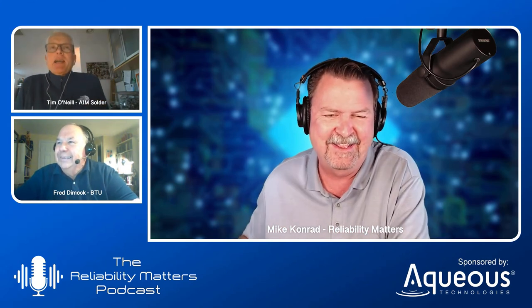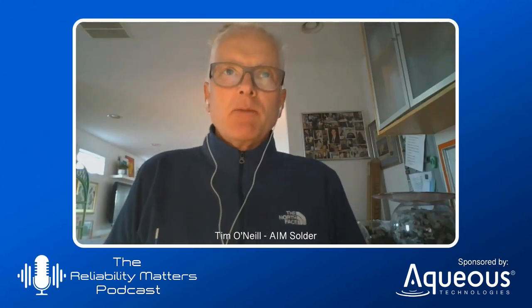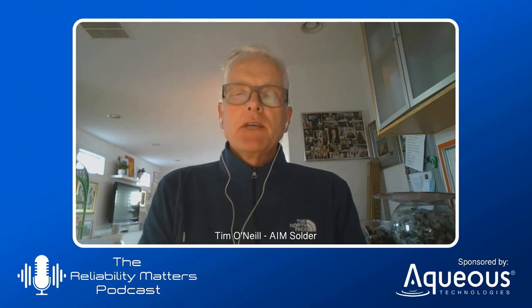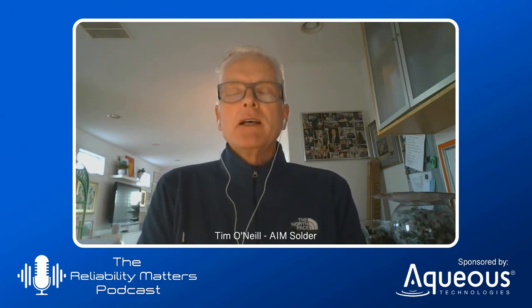Well, define perfect, right? So "I'm following your recommendation" is often what we'll hear. What they mean by that is they've tried to match up our online or published recommendations. And you have to understand, our recommendations are written very broadly. We have to accommodate people that have a 5-zone tabletop oven and people that have a 13-zone nitrogen inerted oven. And so the reflow profile guidelines are written to try and accommodate all of the equipment that's out there. So yes, Mr. Customer, it does fit into the box, but it doesn't mean that it's optimized for your assembly.